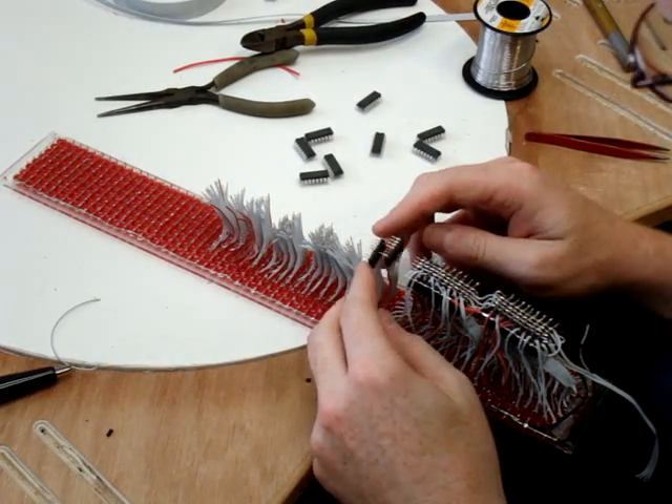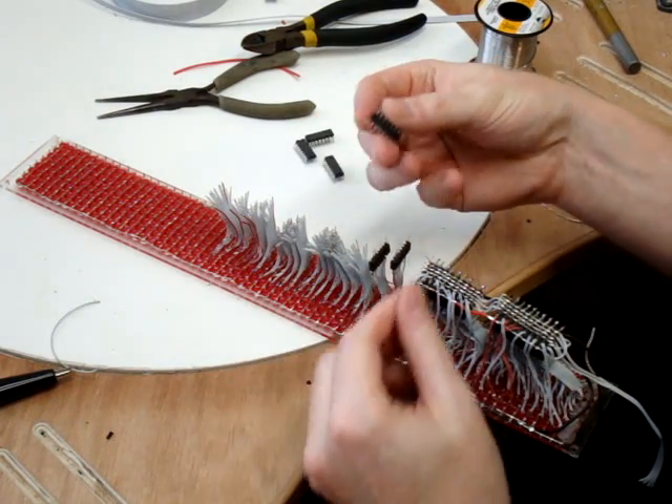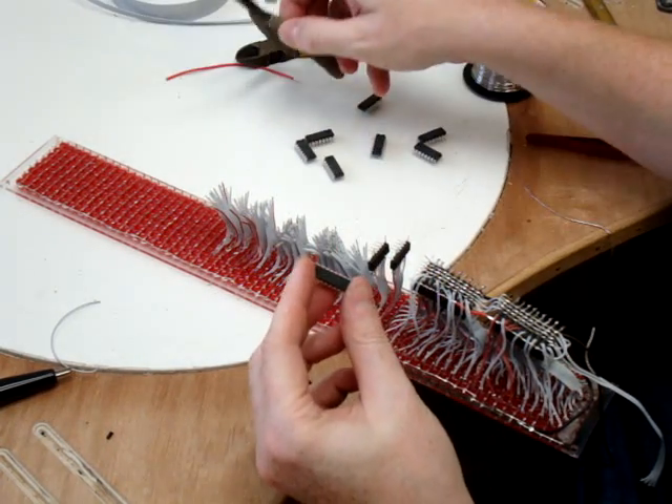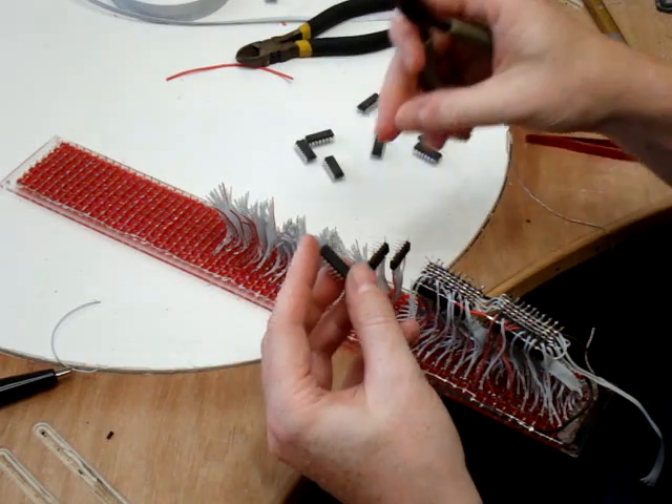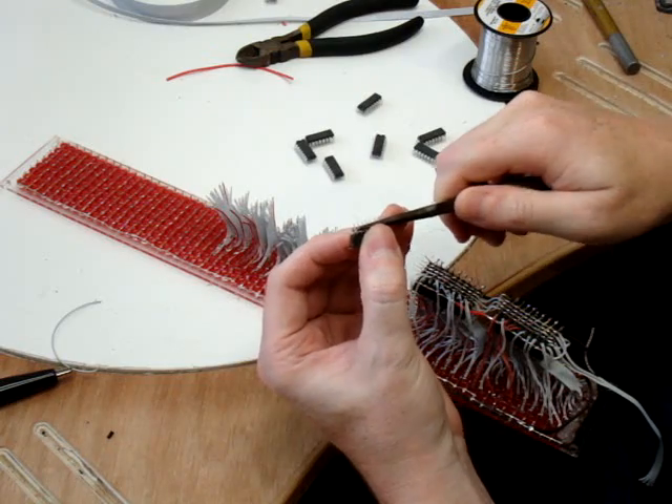More work on Bill Paxson Pinball. I thought I would just show you how the shift registers are being wired up. This is an 8-bit serial input parallel output shift register, which is actually kind of similar to the chip that's inside of a Nintendo controller, except it goes backwards.